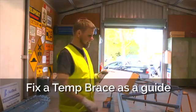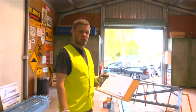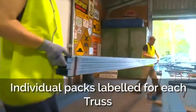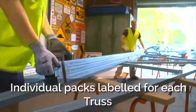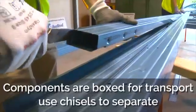You'll have your tables laid out. It's easier to build your trusses one on top of the other. You'll grab your second bundle, cut it, and then open up the pieces, laying them out from the bottom and top to start with.